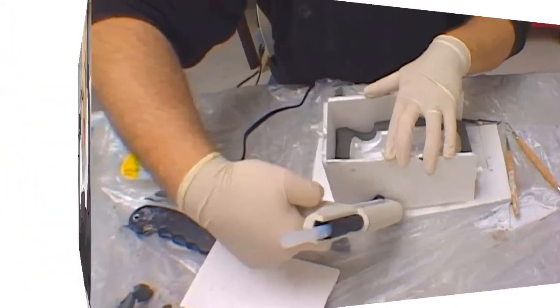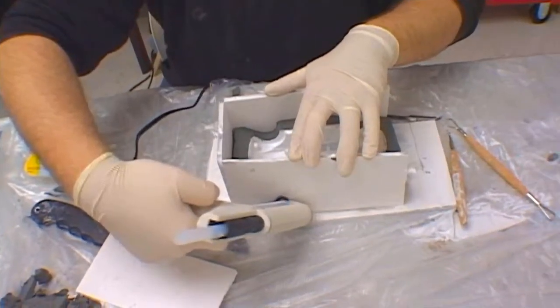This is accomplished using additional foam board on which we have made a 1-inch parallel cut to one side. This allows the foam board to be easily bent around the model. The foam board is pressed tightly against the clay. The outside edge of the foam board is hot glued to the baseboard to not only hold it in place, but to prevent the silicone rubber that we will pour later from leaking.